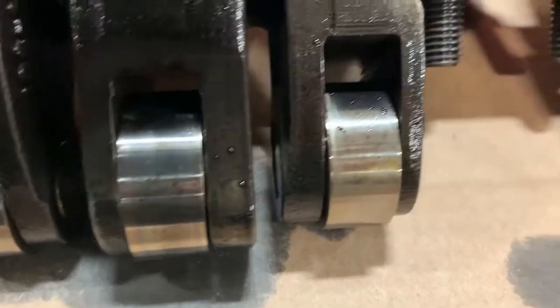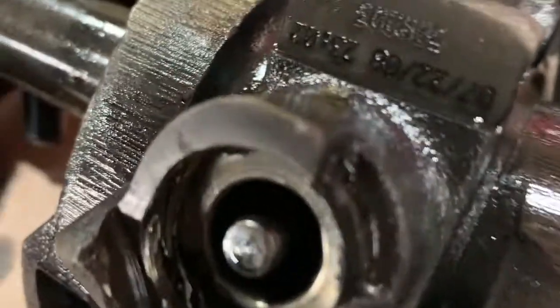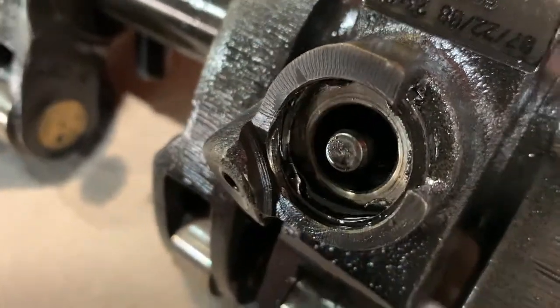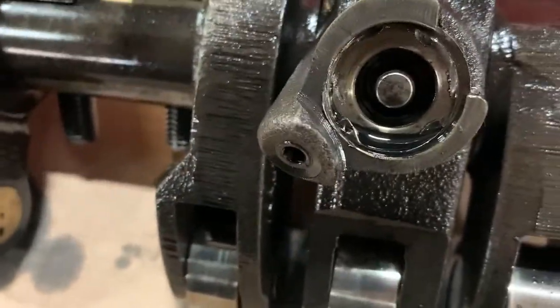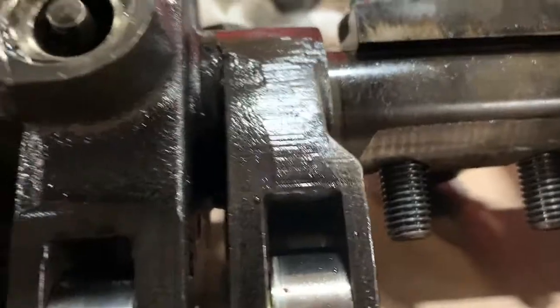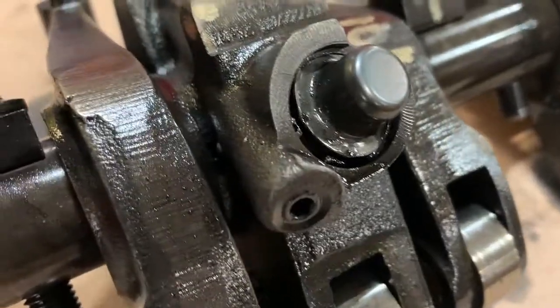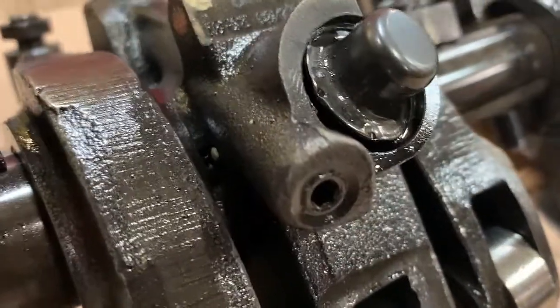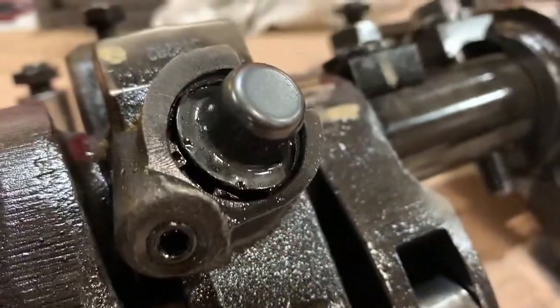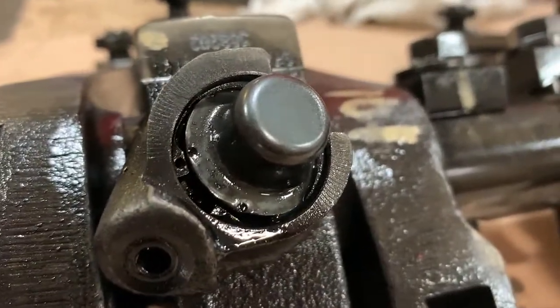Here's a close-up of the Jake levers. You can see the cap is actually torn out of there — the snap ring is still in place and the bottom of the cap is in there. The customer said the Jakes were acting quirky and didn't hold like they used to. Now look at this one — it's on its way out. The cap is pulled out from under the snap ring. It was really just a matter of moments before that popped out of there.